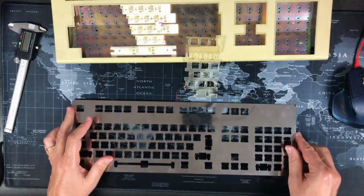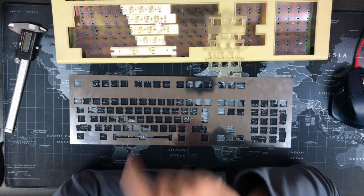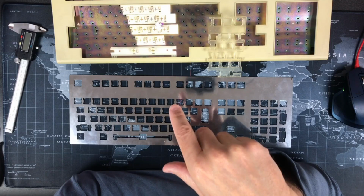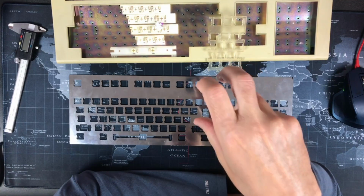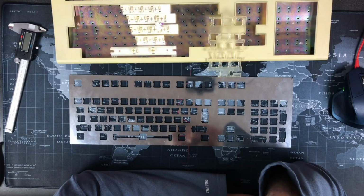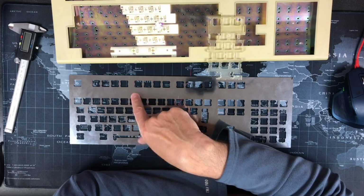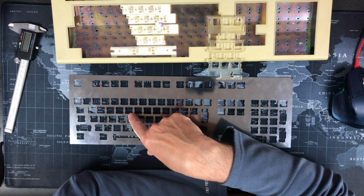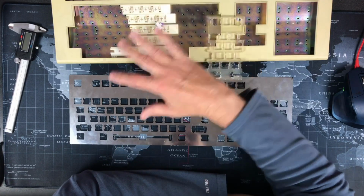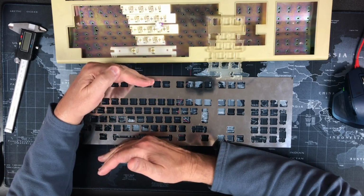But this keyboard has a very unique problem. I haven't dealt with a lot of them, but these Digital Equipment Corporation keycaps are, instead of being 18 by 18mm, actually 19.7 in the vertical dimension. So talk about annoying. That's why this jig will work, because I can make a jig that surrounds that measurement, and it will be centered over the keycap, and that appears to be what they did. You can see the problems that would cause with the standard layout. I can't use Keyboard Layout Editor through Swill KB, or I might be able to, but it's likely that extra 1.7mm is non-standard and won't adapt. Because those keycaps are longer, they're not going to fit the standard size. They are going to be further apart, and the rows are too.